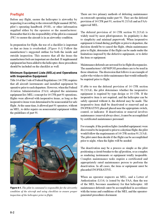For example, if the position lights were discovered inoperative prior to a daytime flight, the pilot would follow the requirements of 14 CFR Section 91.213(d) and decide if the flight can be accomplished prior to night when the lights will be needed. Deactivation may be as simple as positioning a circuit breaker to the off position, or as complex as rendering instruments totally inoperable. Complex maintenance tasks require a certificated and appropriately rated maintenance person. In all cases, the item or equipment must be placarded inoperative.